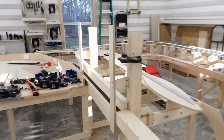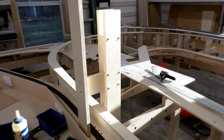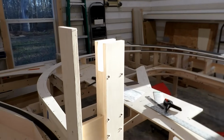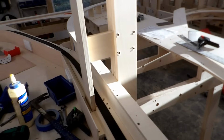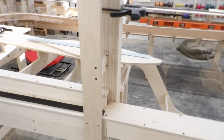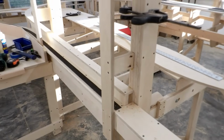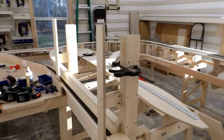Well, last night I realized that I'd forgotten to make a clip before I went in. Here are the first two posts for supporting the upper deck. There will be a double beam across the top where the top deck is cantilevered out, more or less as I showed you on previous railroads. The only difference with this one being that it has to be wider because I've got a couple of tracks through the middle of it. This one is split between the two frames, and the right side of it has to be screwed only, it can't be glued. Well, the parts that are on are glued, but the back half of it has to be able to come off along with the top piece for transportation so that it fits down the client's basement stairs.